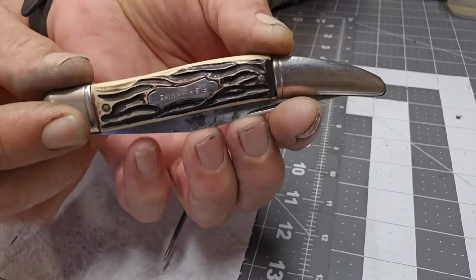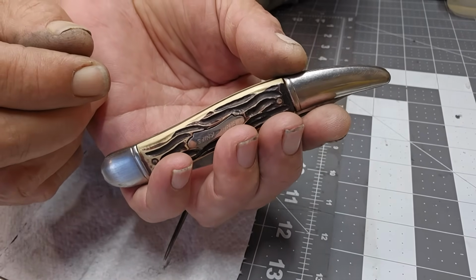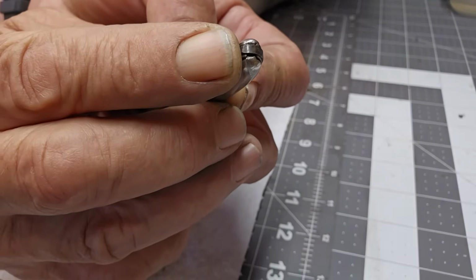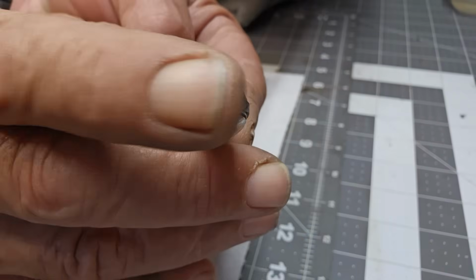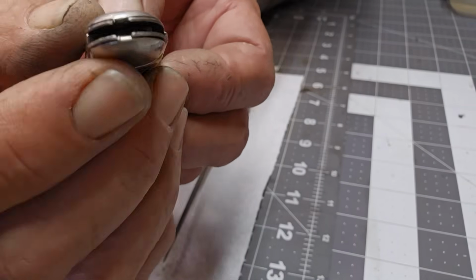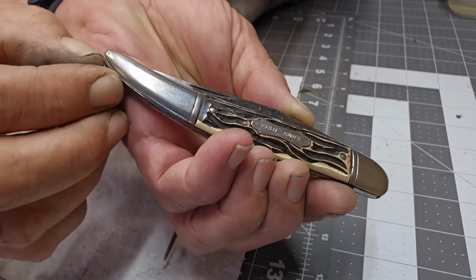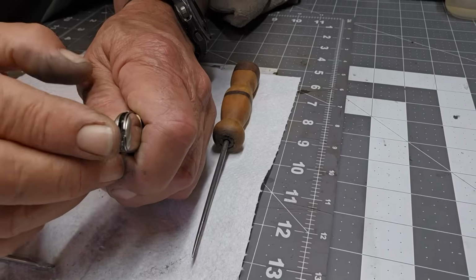Clamshells now. Two things you need to know. The clips of clamshells are delicate, okay? You can't keep opening and closing them. Just like anything, they will eventually break off. Here's the first two right here on the end. And as you can see, you basically have no access to them. You can't get to those. You have to start this side, take these clips and open them because you have access to them. You can see it there. And then you can lift it and slide it down towards these ones, which these will pop out and you can lift it off. Just got to be really careful with these clips.